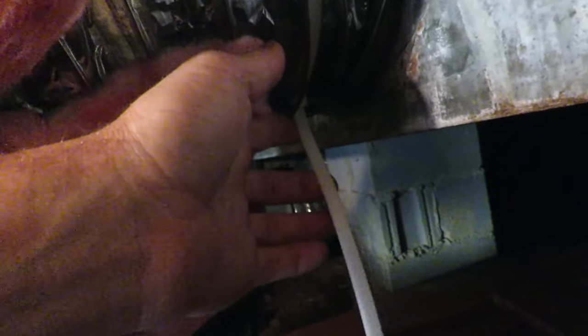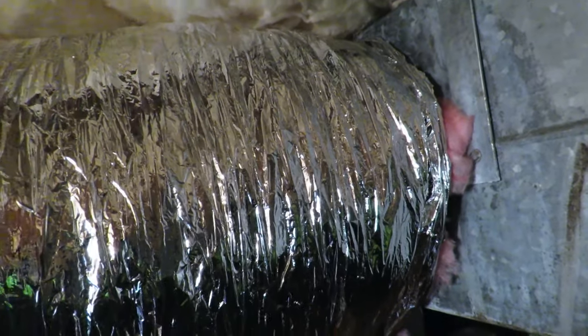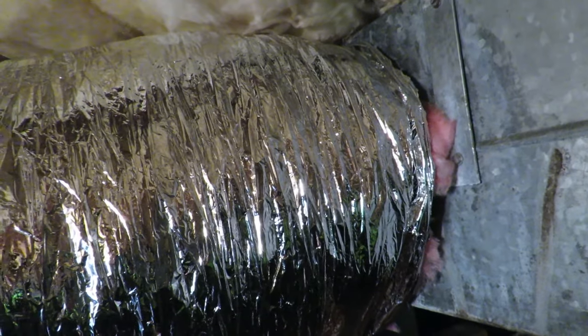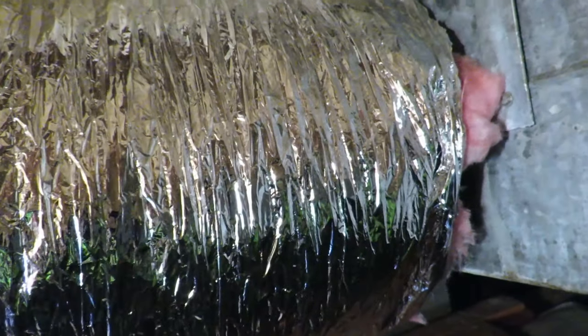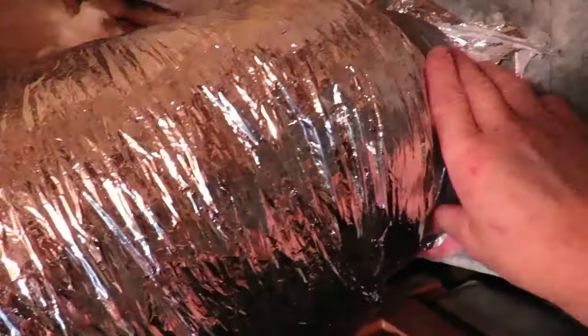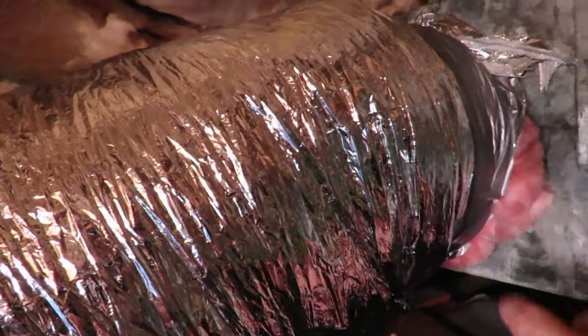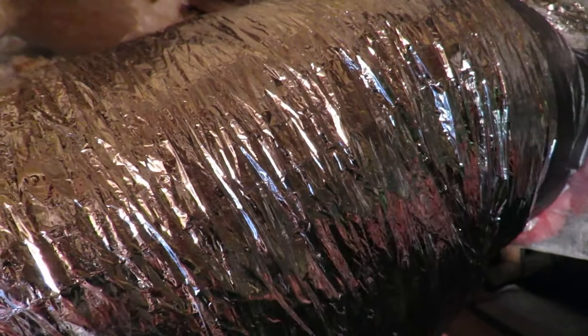I've got my zip tie all the way up and this is nice and all the way into the front. Then we want to pull all this insulation back up around here so we keep the box and all the pipe work supplying the air nice and cool. We still need to clip off this little tail - we don't want to leave that hanging out. The pipe is fairly straight, there are no kinks in it. Now what we need to do is tape the end fairly tight around it so the insulation part won't work loose either.